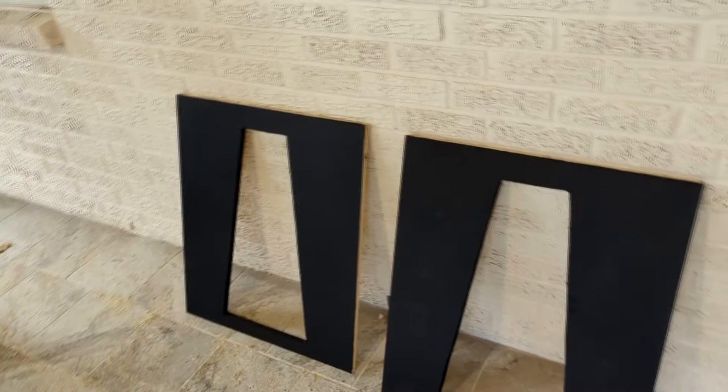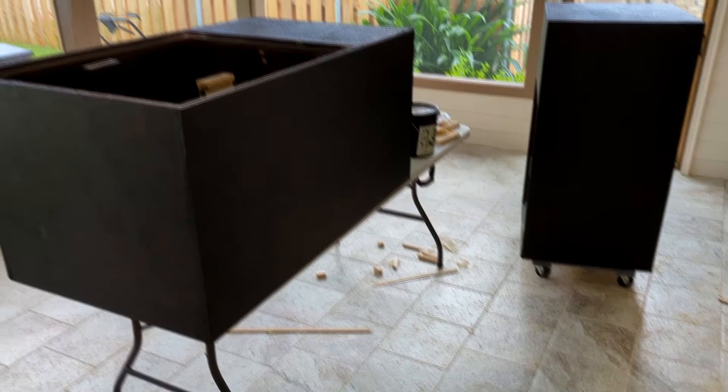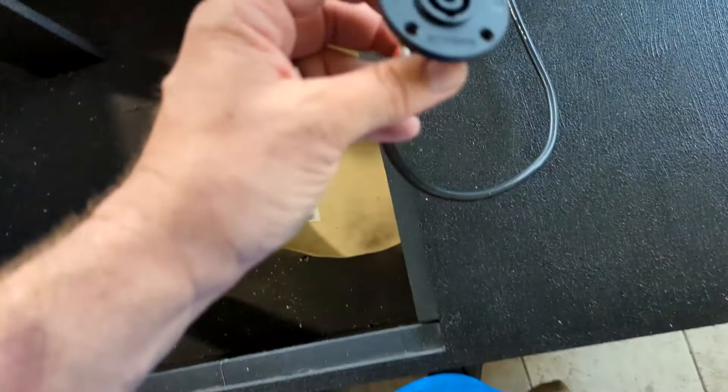Now I'm going to run inside and wire up the jack plates. I like to use actual Neutrik — the real deal, not the knockoff versions. You're going to go this far — these are hard cabinets to get into and work with, so you might as well wire it right. You're going to have to drill in the back about 8 or 9 inches down from the top and reach in and grab your cable. That's going to give you plenty of cable — I only have about a two foot whip on it.